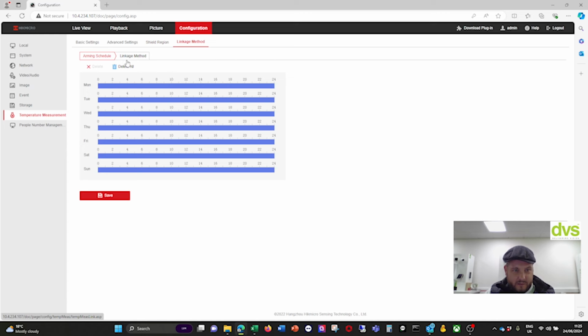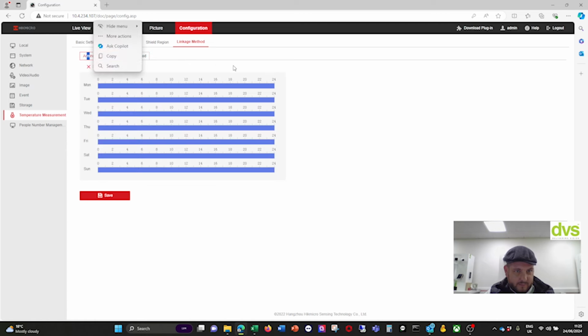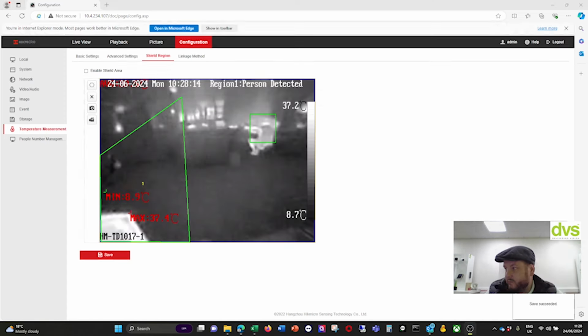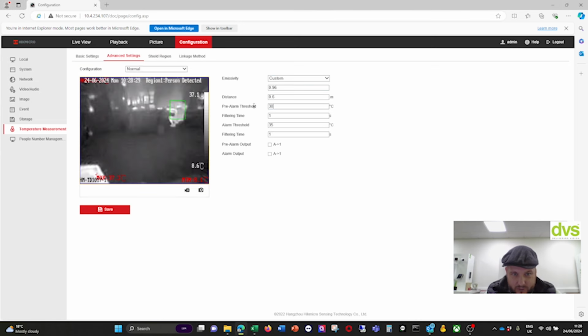So linkage method, and then I can put notify surveillance center, send email, audible warning, click yes. You can see, obviously, I've started to do the temperature management. It's jumping all over the place. So what we are going to do is, under advanced, I'm going to put the pre-threshold at 40, and I'm going to put that back to 55. There we are. I had it a bit too low, but it was more just to show you.